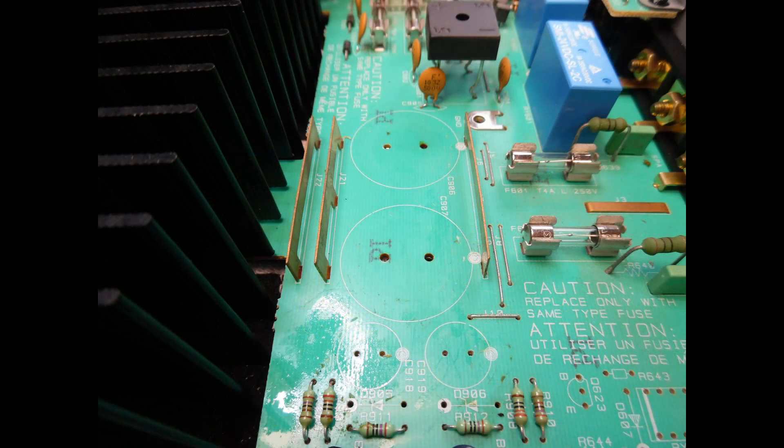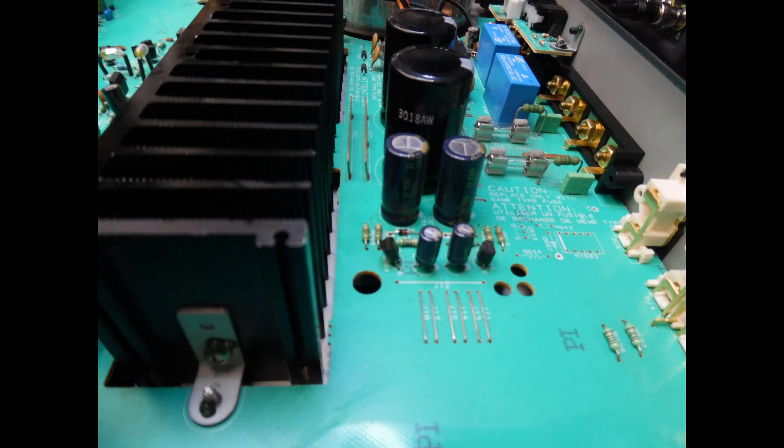What you now see is the board completely cleaned. People often ask what I use to do this — don't go in with a metal screwdriver because you'll scratch and mark the board. What I use is a plastic tool normally used for removing labels. Take your time, wear your eye protection, and you should be able to return the board to the condition you see here. I don't need to replace the electrolytics themselves since the glue only coated their plastic covering, and while the capacitors were out I also checked them with the ESR meter to confirm they were within manufacturers' tolerance — in this case they were.